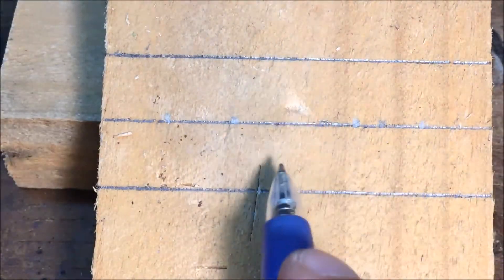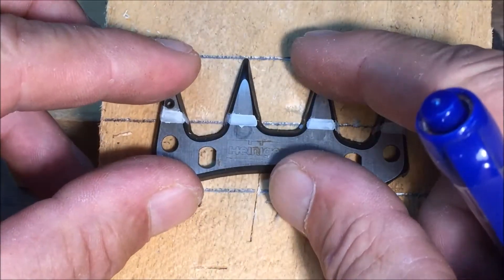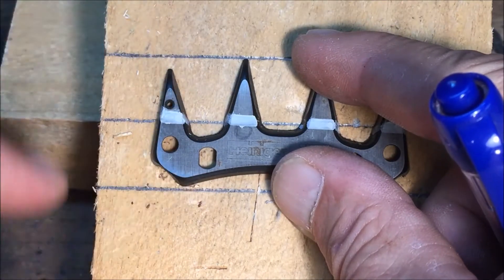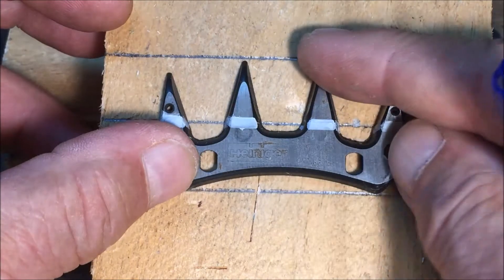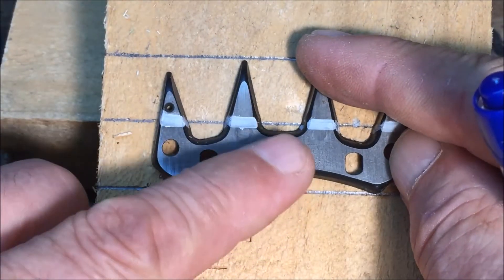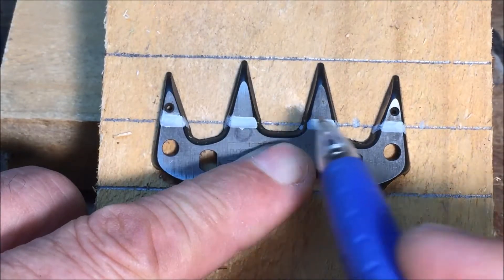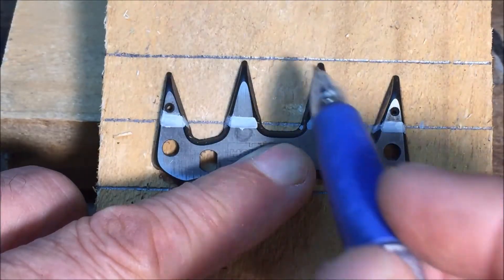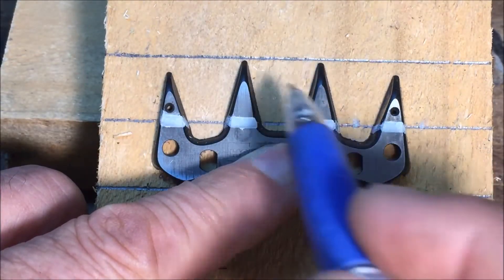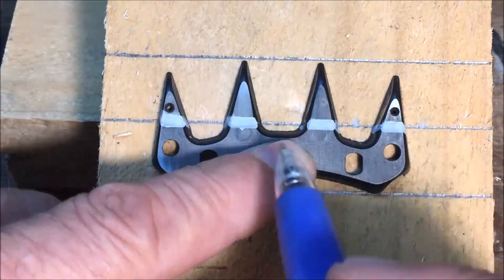Effectively we've got a block of wood — or a bit of paper — with three lines on it. Set the cutter on top of it. You can keep this block of wood laying around the shed, around your grinding shed, and use it time and time again. Put the cutter directly on top of the lines, then put a line through your cutter so the lines through the cutter run on top of the lines on the block. Note that we've taken the tip of the middle teeth — not the outside ones — the middle teeth back corner, and put lines through it.